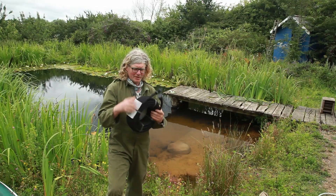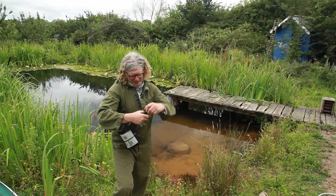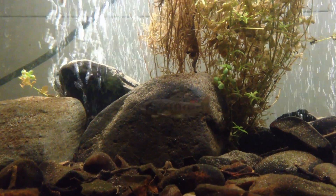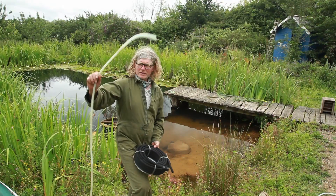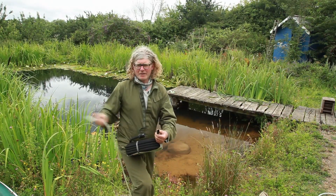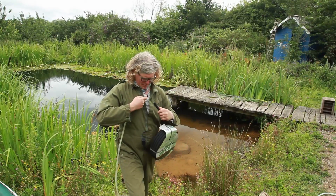I was very excited about this, so this is how you do it. This is the hose — about 15 millimeter diameter, made from recycled rubber, porous. I put some of this in a fish tank with some trout fry and they're perfectly healthy, so this stuff seems to be pretty well free of toxins. It's simplicity itself to connect up — this is just standard air hose, eight millimeters internal diameter. The other end plugs into the compressor over there. It just pushes in — can you hear that? Air is already coming out of it.